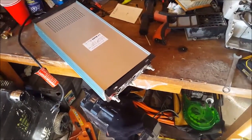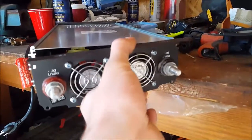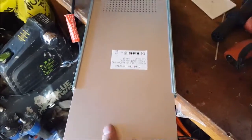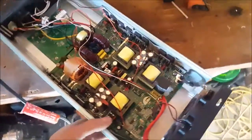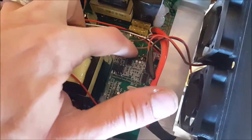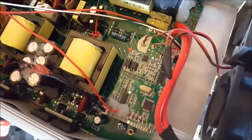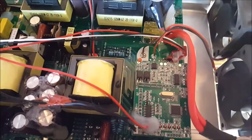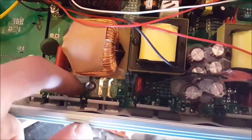I've removed four screws so I can pull this down just enough — there we go. Pull the bottom out and put this off to the side on my messy bench. So I've got my two fans wired into where the capacitor goes. It has a spot for two but they only have one, so I wired my fans in there. I need to take that off and wire it back to where the fans used to be — they used to get their power from this thermal temperature sensor.